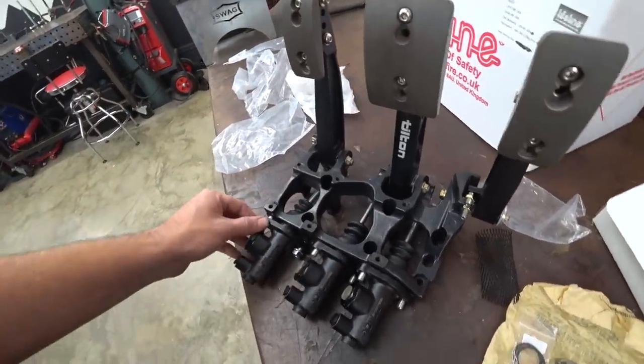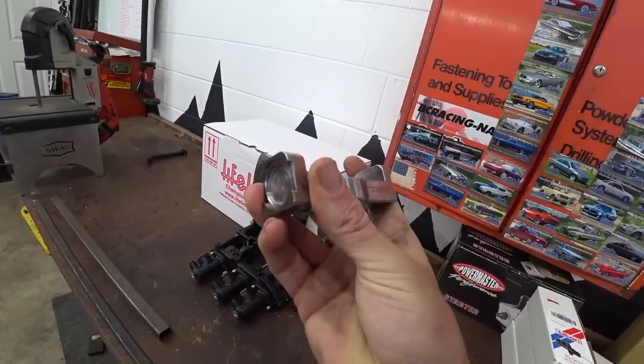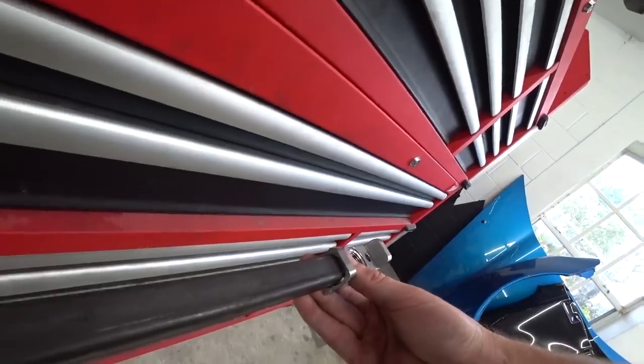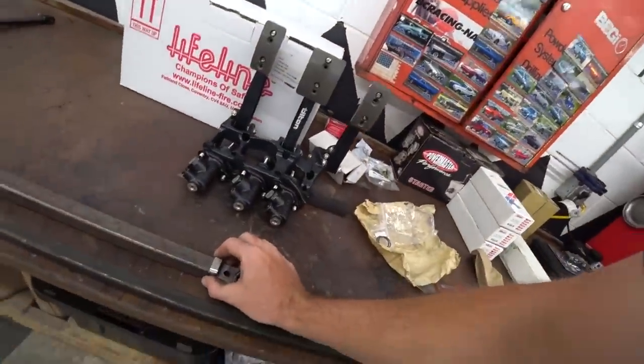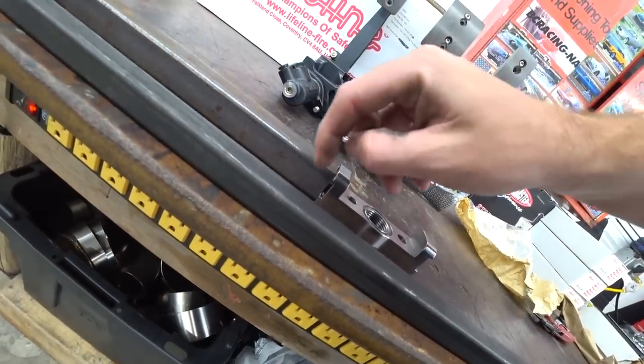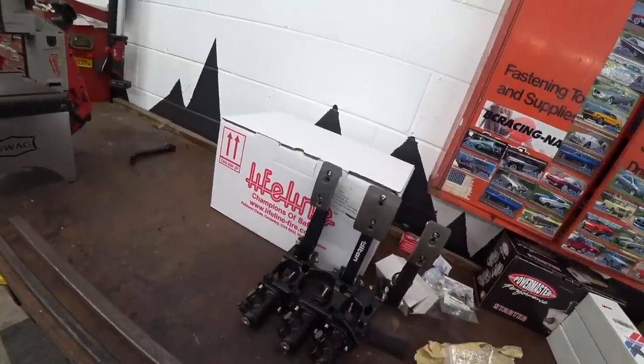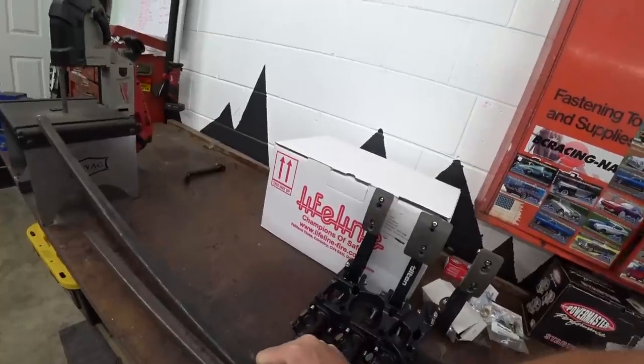We moved on to the turbo mount, which is designed around round tubing so you can plug weld or butt weld it. My tubing bender is still in storage and I don't have the dies for this size tubing anyway, so I thought maybe we'd just do it out of square tubing — it's a pretty short run. I've got two different pieces of square tubing: one for plug welding with more meat on the weld, or one for butt welding. I'm leaning toward the thicker, bigger one — the smaller one has too much flex.